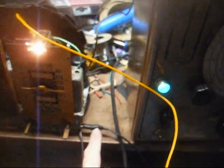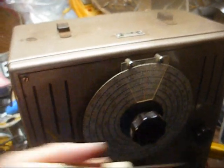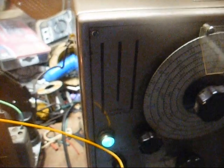So, radio plugged into an isolation transformer, signal generator ground connected to chassis, signal generator hot lead connected to the grid of the 12SA7 through a 0.01 microfarad capacitor. Volume on the radio cranked wide open. Signal generator up just high enough to get me enough output to get a usable indication. If your signal generator output is too high, then that will cause the AVC circuit to kick in and that can give you false readings.